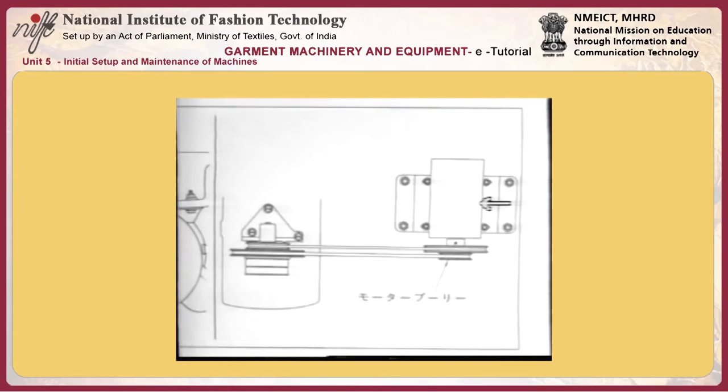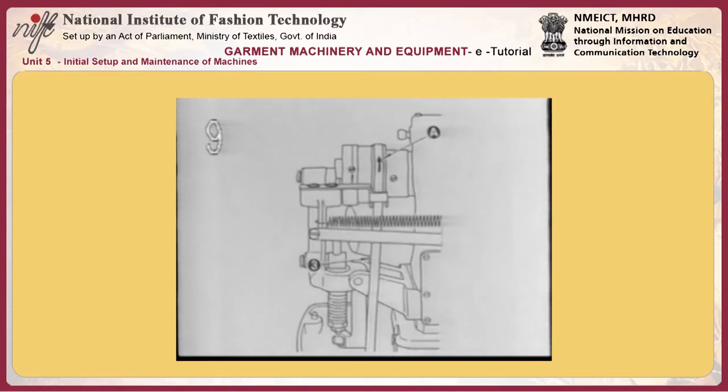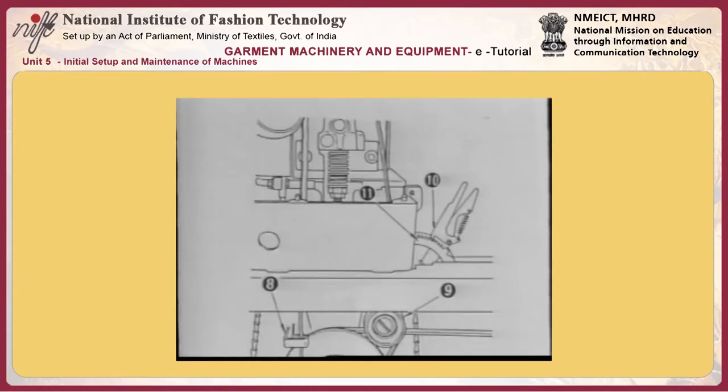8. Adjusting the V-belt tension. Adjust the tension of two V-belts so that both of them sag by approximately 10 mm when you lightly press them. The V-belt tension can be adjusted by shifting the motor to the right or left. When adjusting the V-belt tension, take care to straighten the V-belts.